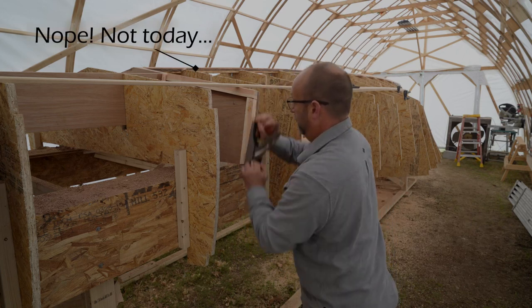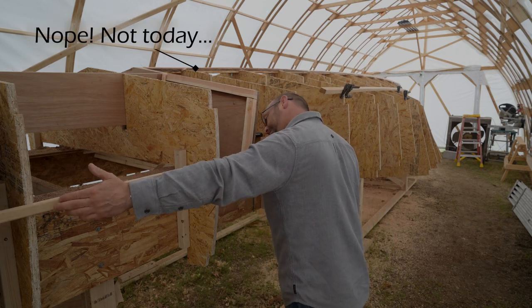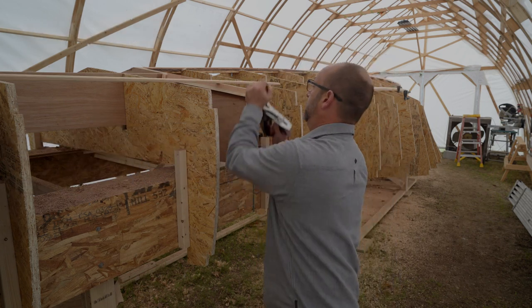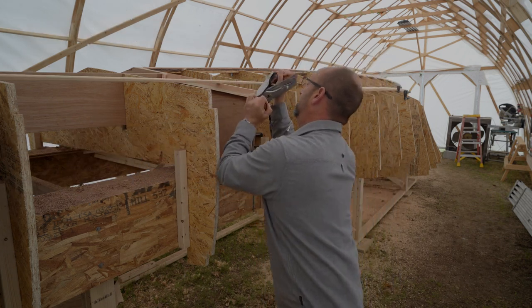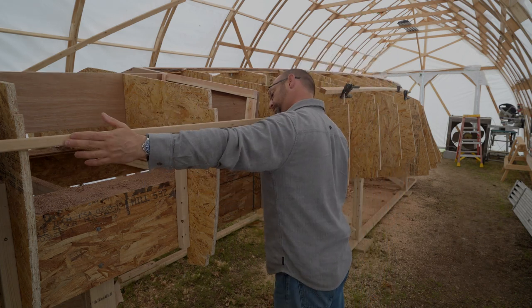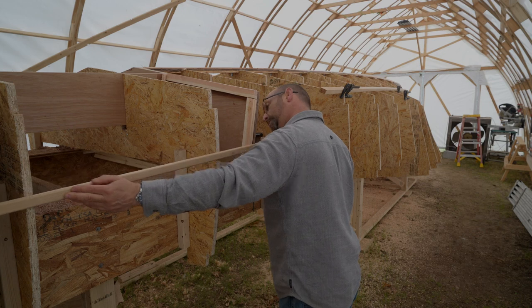Really what I'm doing here requires little explanation. It's as straightforward as it looks. I just laid a batten across the station molds, let it take a fair curve, and where it intersected anything that stuck out too far, I just started erasing wood until there was no longer anything in the way. Overall, it was a nice couple hours out in the boat shed.